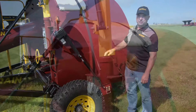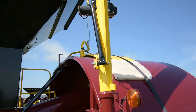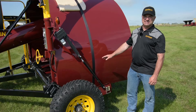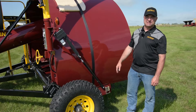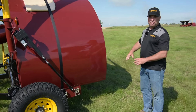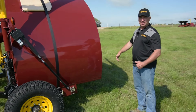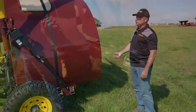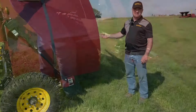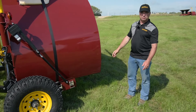ProGrain Equipment uses a cradle system to put our bag onto the tunnel on all our models. On the B1610, there's a boom to assist the up and down movement of the cradle. You simply put the bag on the ground, open it out of the box, put the cradle inside the bag, and winch the cradle up and onto the tunnel. The bag stays on the cradle the whole time when you're bagging.